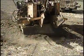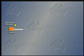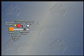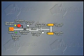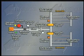Here is a diagram showing the layout of a subsurface drip irrigation system. First in line is the pump, followed by a vacuum breaker air release valve, a pressure relief valve, fertilizer injector, mainline valve, pressure gauge, water filter, pressure regulator, and a second pressure gauge. Water passes through the main line to the sub-main, which is fitted with a valve either side of the main line and vacuum breaker air release valves. Lateral dripper lines are connected to the subsurface distributor and collector, which is also fitted with vacuum breakers and valves.